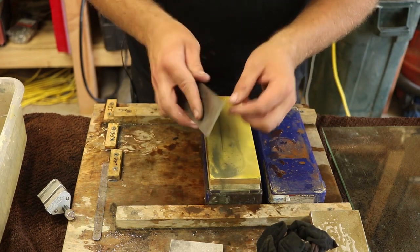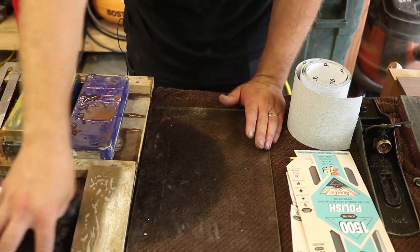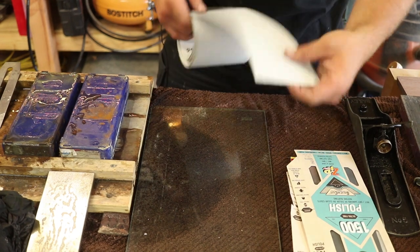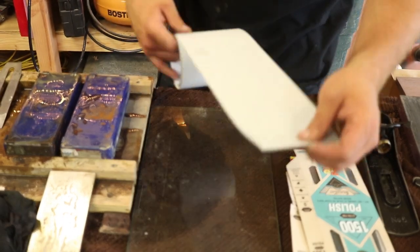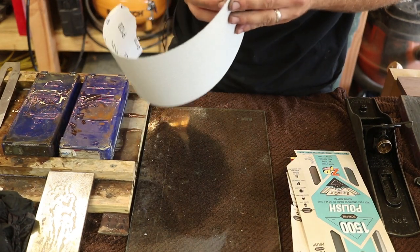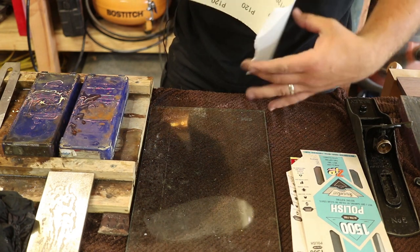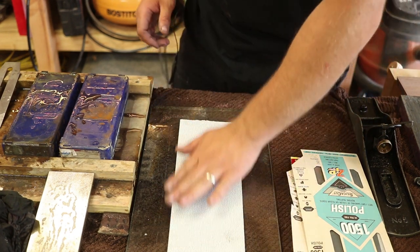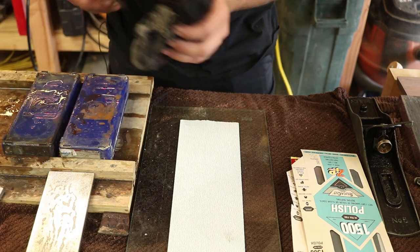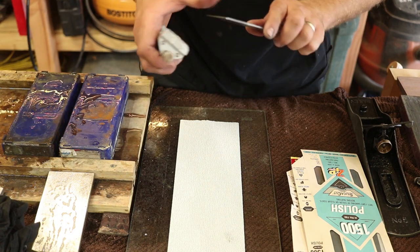Now I'm going to work on the cutting edge, and I'm going to show you how to do that using the glass. A method I just showed you — you can flatten the back using the glass and sandpaper too. I'm going to start with this roll of stick-back paper that I found at a woodworking show. It was only five dollars for the big roll. The paper wears pretty quick but it's nice that it's stick-back. It's pretty coarse — about 120 grit — I have a 150 grit roll too. This is what I use if I have a deep nick, or I'm flattening the bottom of a plane. This is a new blade to me so I'm not really sure what the angle is.